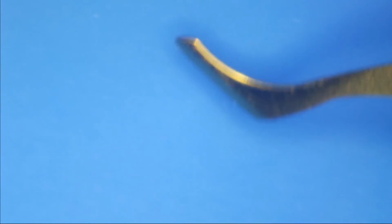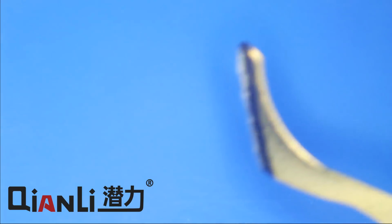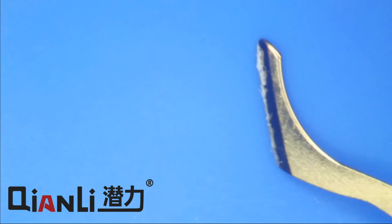And what that is for is, I don't have a good example here, so let's just pretend that this is a board, my blue mat. After you have removed a chip that was underfilled, this is for putty knifing away the remaining underfill. This will go straight across the pads, the underfill, and everything. This is a cleaning tool. It works just like that. It's for cleaning. You add a little heat, and then this tool will raise up and scrape the underfill away.